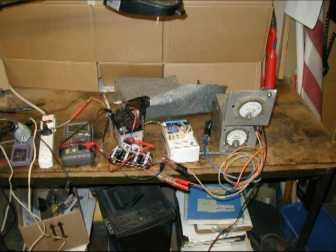The current test setup here consists of the 4-wire CNP pack to be tested under a sheet metal shield, a small 12-volt wet cell for basic coil saturation testing, a simple homemade variable output linear power supply for checking saturation time changes with voltages below and above about 12.5. There's also a single pole double throw switch that is used to switch between the wet cell and the variable power supply, an Arduino Uno controller to simulate an engine but only providing variable coil charging signals between 1 millisecond and 8 milliseconds, and simulated RPMs between 100 and 6,000, and finally a digital multimeter to measure the applied voltage.